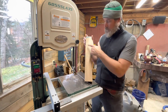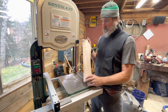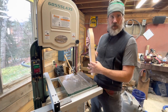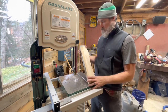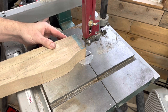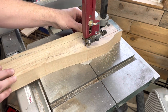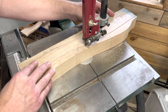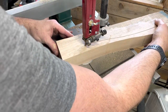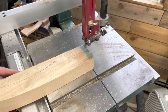First, you don't need much help laying a pattern down — we're just tracing the outside of either a pattern or an existing handle that we like the shape of. This is eight-quarter lumber so we'll need to thin it down eventually. Use light pressure and let the saw do all the work. Don't drive it in, just follow your pattern. If you're having to push too hard and getting burning, you might want to check how old your blade is.